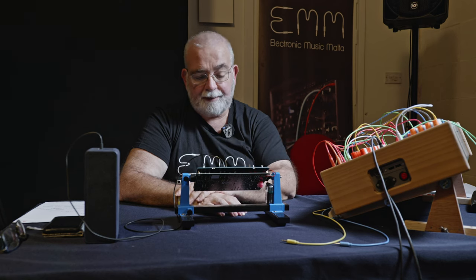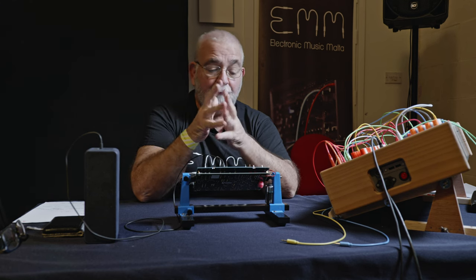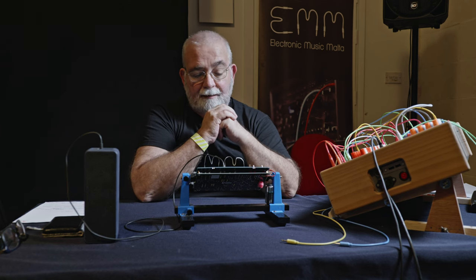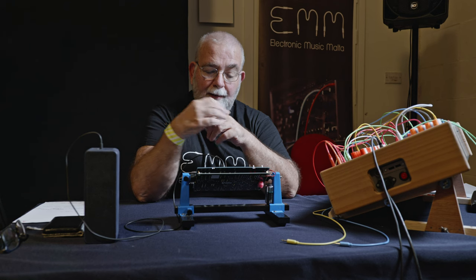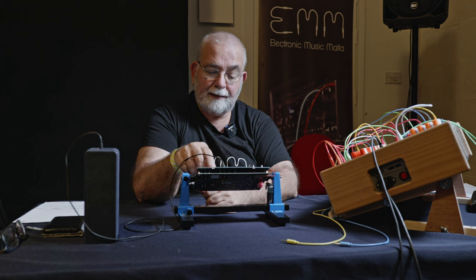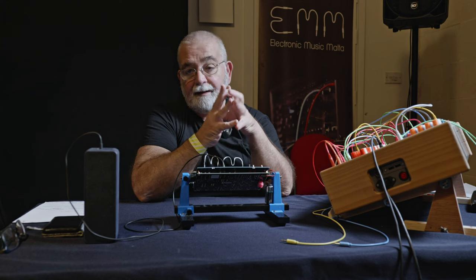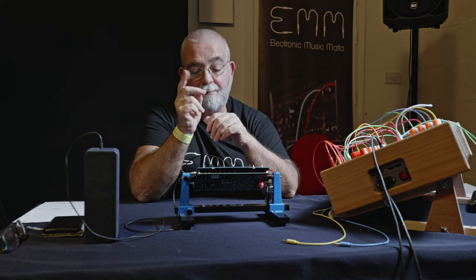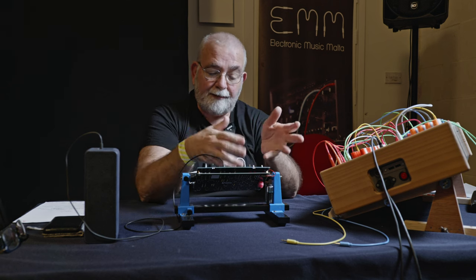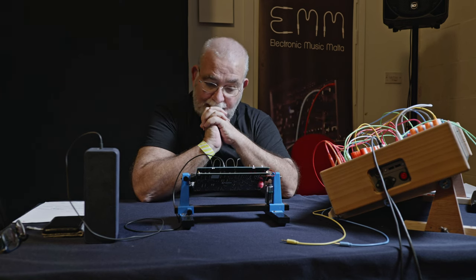The oscillator, the clock bit generator, has the possibility that it can be run in random mode. Rather than programming the generator to output a constant adding of the number, we can turn that into something a little bit chaotic by bringing in 3 separate generators generating a single bit to make up the decoding word for the 3 to 8 demultiplexer, so that it can go absolutely nuts. And we get this.